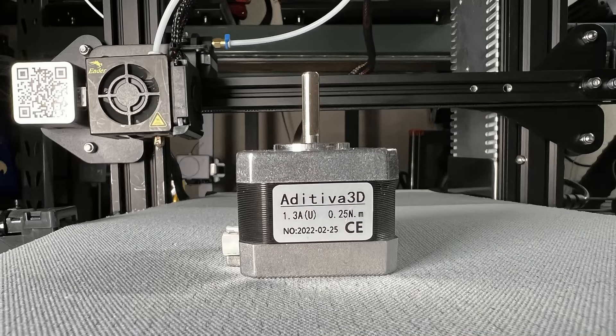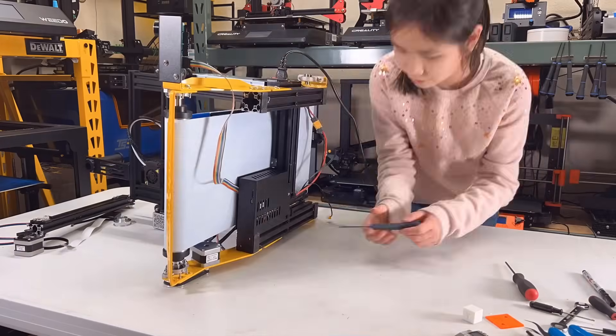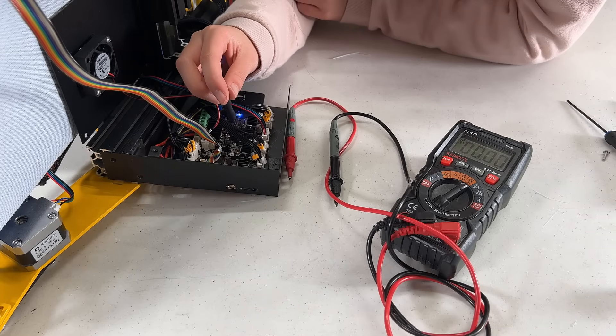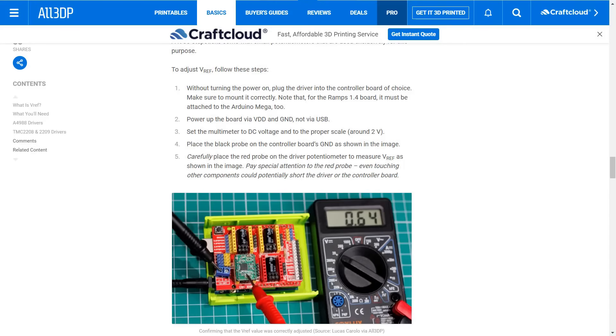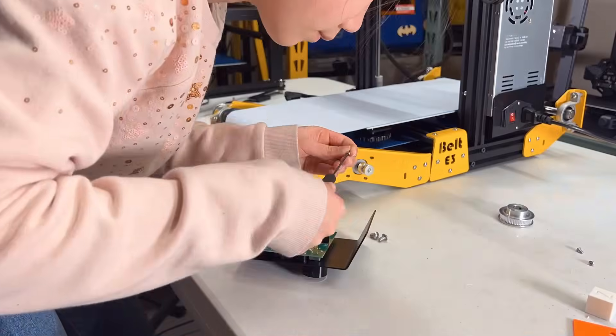This kit came with another stepper motor — a NEMA 17 34mm with a rated current of 1.3 amps — but I will just use a set of NEMA 17 40mm motors with a rated current of 1.7 amps. In order to get the best performance from these motors, I will increase the voltage reference from 0.9 to 1.5. This may be a little bit too much, but I will keep this current to make sure they hold enough torque unless the motors run hot. I will leave a link in the description if you want to know more about this. As the two motors are installed in opposite directions, I need to flip one set of the wires to make them turn opposite to each other.